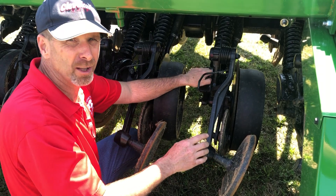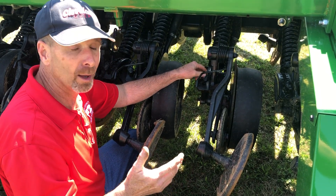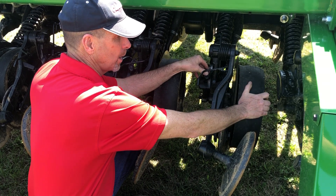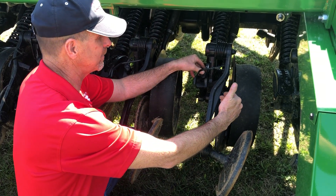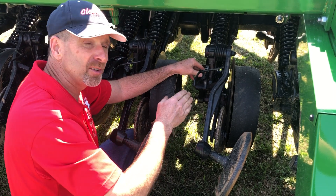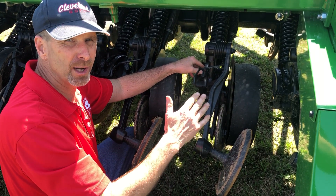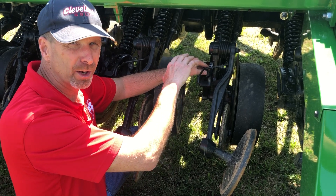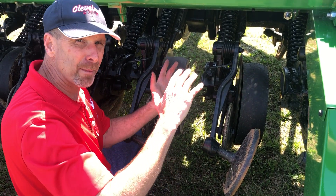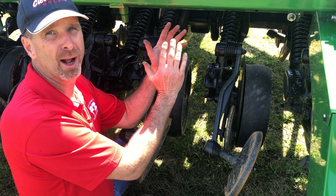When we talked about the hydraulics of these drills, we discussed not running too much down pressure and the possibility of losing depth control. If you look at the openers, the depth gauge wheel — this rubber-faced wheel — has its axle centerline running behind the centerline of the coulter axle, and the opener drops seed out at about the bottom axis of the coulter. If you run too much pressure, it causes the rock shaft that all the openers are fastened to to over-rotate toward the front of the drill, and the depth control wheels actually start to push the seed opener up out of the ground.